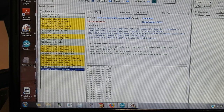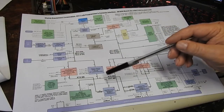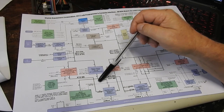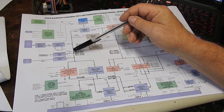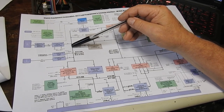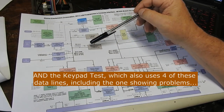I've found another way of enabling the switch register onto the data bus that doesn't involve using the switch register address decoder, and I'll run that test now. No problems. The fact that we get the same bad bit in the low byte and the next byte, for both address and for data, points to something along here where it's 8 bits. One bad line there would explain all of that. Except that the RAM test works and reading the ROM comes out correctly as well.